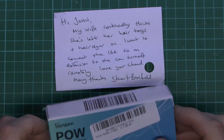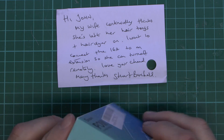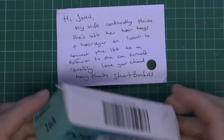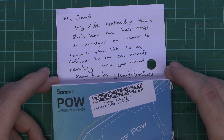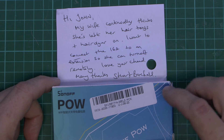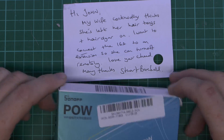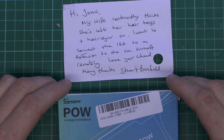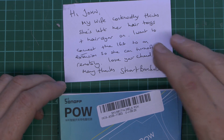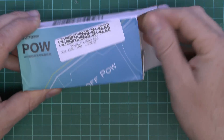So here's the 16-amp version, and Stuart sent this one in. Particularly being 16-amps, it's quite relevant for the UK because outlets and sockets in the UK are generally rated to 13-amps, and that means the previous one we saw, the 10-amp version, would not really be suitable for controlling that. But the 16-amp one most definitely would be, so in the case of this one you could attach it to a socket for hairdryers or tongs or whatever. So let's see what we've got here.